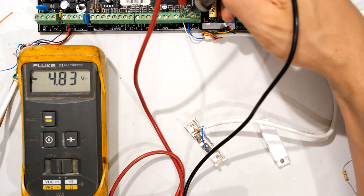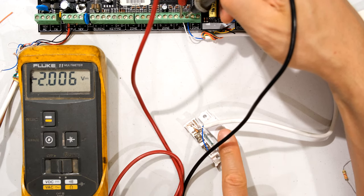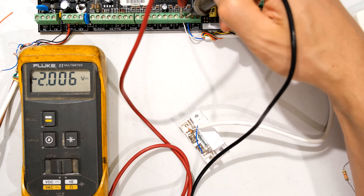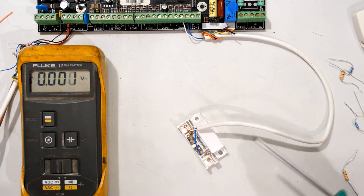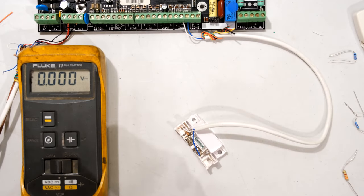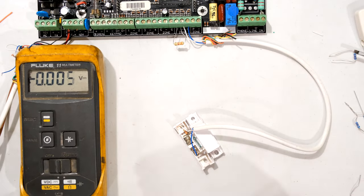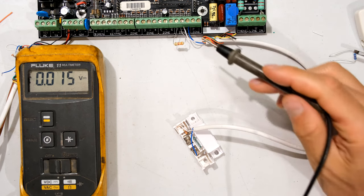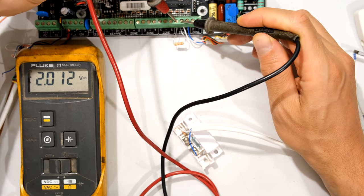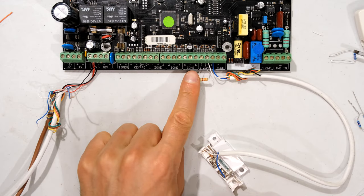The voltage must change when you open and close the zone — when you violate the zone. The reason I use this magnetic door switch is so I can go along all eight zones and check I get the same voltage for each one. If you don't have one, just use your end-of-line resistor. For example, I'm putting a 3k3 resistor across zone seven — when I measure across zone seven I get about 2 volts, the same as zone eight. That confirms it is working.